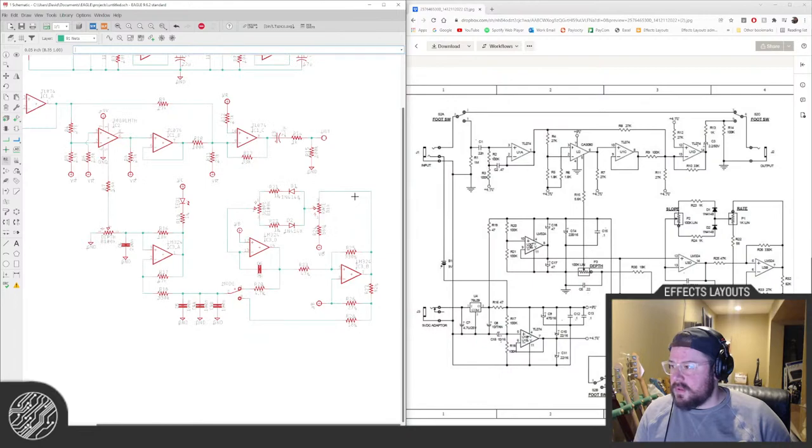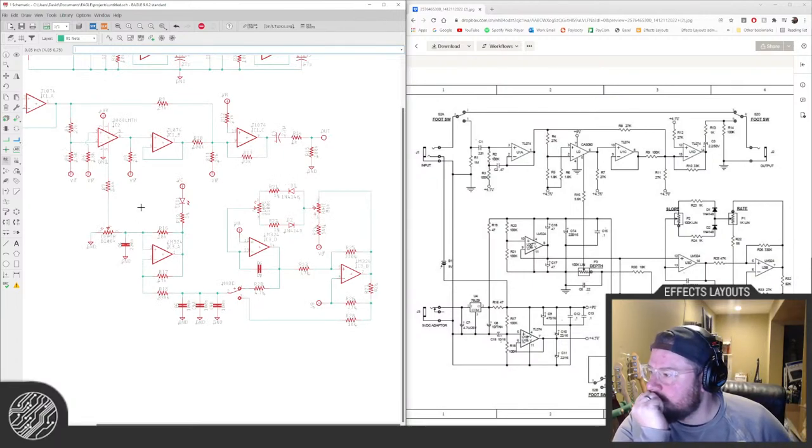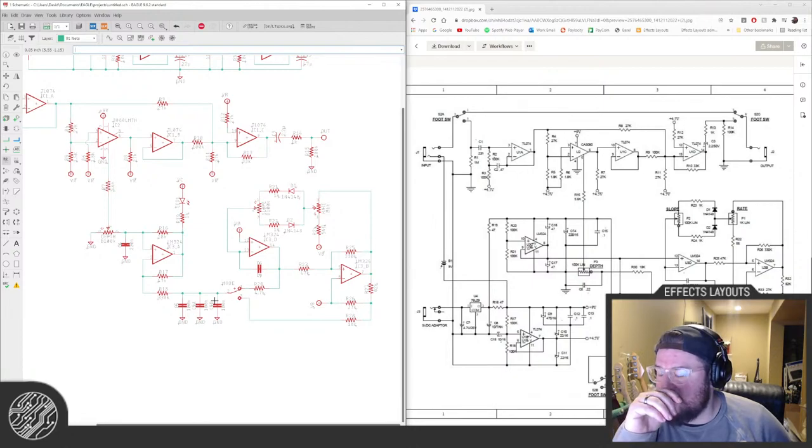I think that's everything. Yeah, I'm betting since these are all, they were just trying to make a 330 or 300 nanofarad cap and just had a billion 100 N caps on hand, so they just stacked them. Yeah. We'll leave it. People can experiment with different values if they want to.